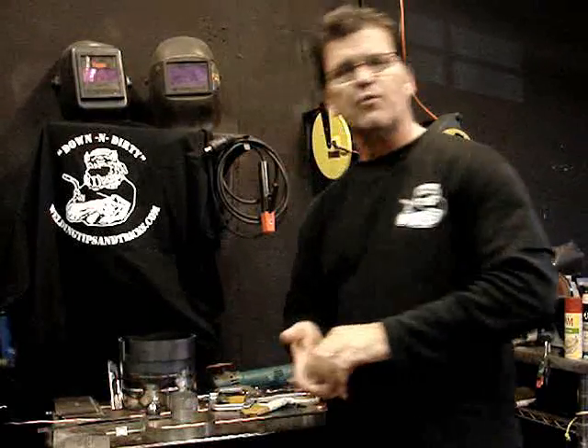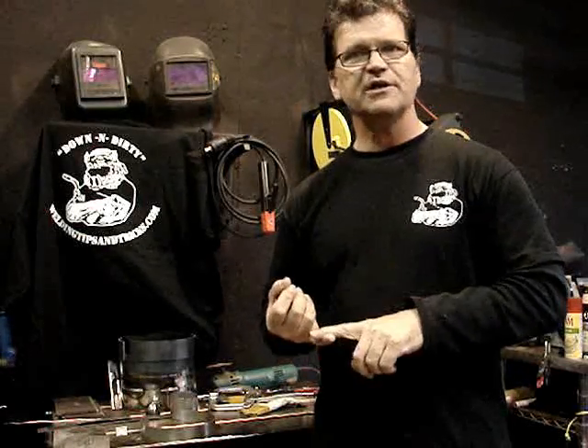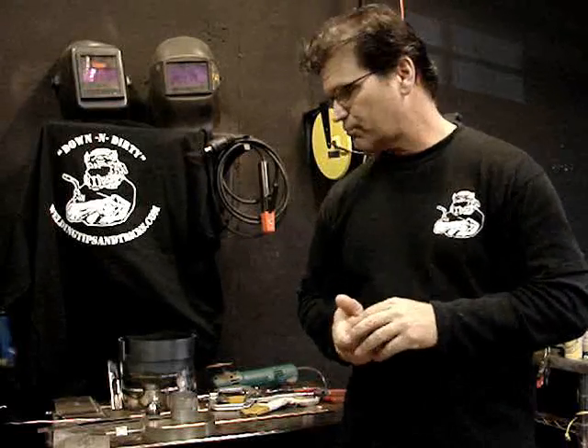300 series stainless steels are largely what people talk about when they think of stainless steel, and the most common is 304. It's pretty good on corrosion resistance, weldability, and everything else, and it's the most common. It's what you see behind the counter at McDonald's, your stainless steel fork and spoon, beverage containers, beer kegs, maple syrup pans, dairy farm piping, tanks, and containers. All is largely made out of either 304 or 316 stainless steel. Those two are the main food-grade and marine-grade stainless steels. 316 is more corrosion-resistant.